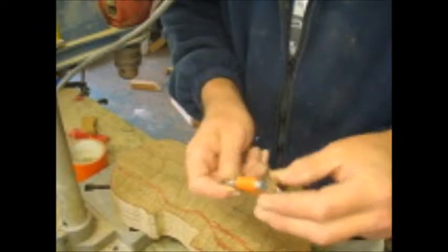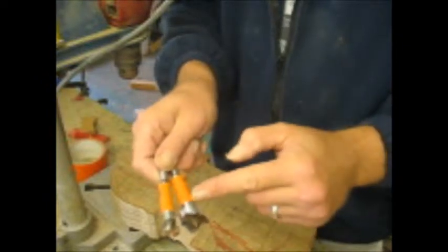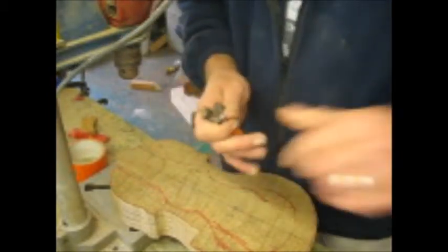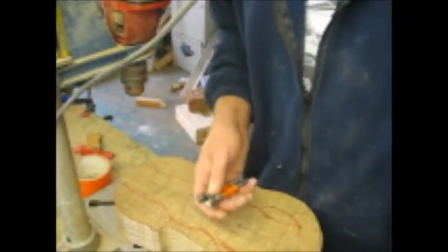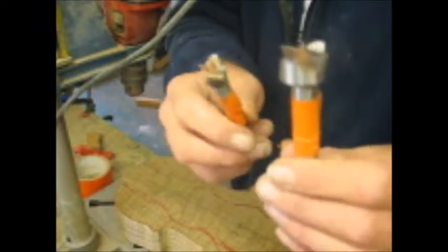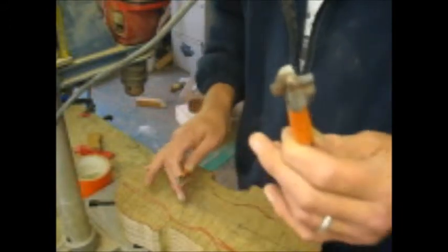What I've done now is I've marked my drill bits at 2.3 from there to there so I know I can bore in up to there. I might go a little bit shy at that because I've still got a couple of millimetres. I'll be doing it with a drill press — obviously not everybody's got a drill press. I didn't have one until I found this in a second hand shop. The drill included, 10 francs which is about seven quid, so you don't have to have expensive stuff. You could do it by hand. If you haven't got these sorts of bits — these are for doing cabinet hinges and things like that in various different sizes — just use the biggest drill bits you've got and you'll have to finish it off at the bottom with a chisel.